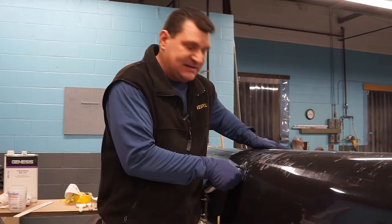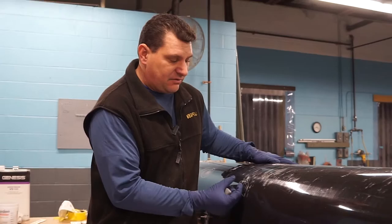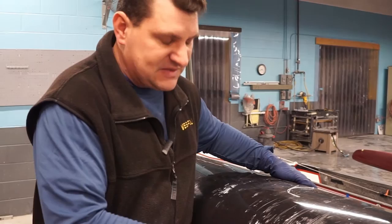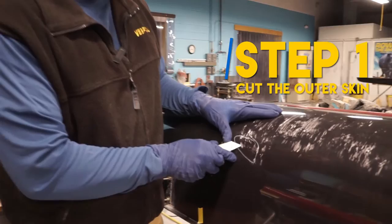What we're looking at is a small dent or delamination. A delamination means that the inner skin or outer skin of the boat has delaminated from its core. We're working on a Vespoli ultralight which has three layers of carbon, our Nomex honeycomb, and then three more layers of carbon on the inside. There's actually a crunching sound from the boat, and that's letting us know that's a delamination. But it'd be the same thing if we were fixing a hole through the boat or a puncture or just a dent that didn't have the delamination in it.